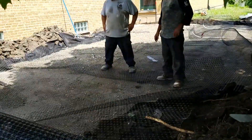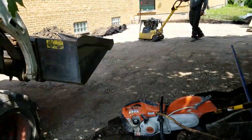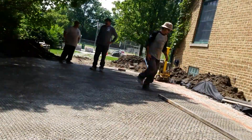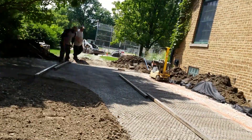This awesome stuff you see here is called GeoGrid. The specific one we are using is called Unilox DriveGrid. It traps the three quarter inch stone in half inch triangles. It's 15 feet wide by 150 feet long, which creates a mesh that prevents any stone above it from settling if the stone below it happens to settle.